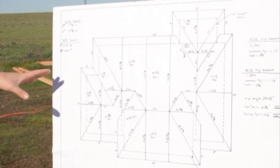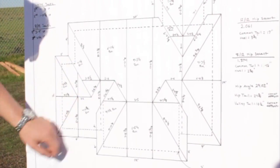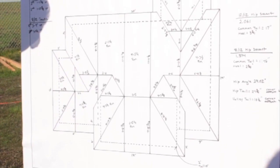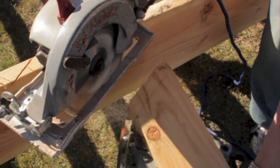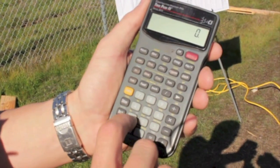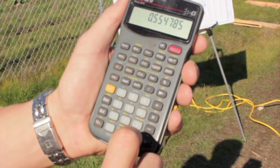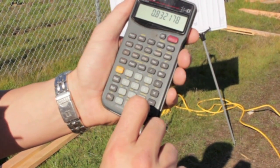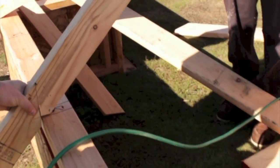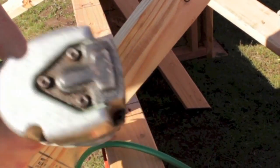When we get back on site, we're going to see that we've got our plan board with all our measurements and calculations, and then we're going to start cutting. We're actually going to assemble the roof on site and show you how to cut all of these rafters' hips — show you exactly how to cut them on the saw and how to use them. We're going to show you how to stack and put the rafters together. There'll be a few more bevels and hip backing bevels that we'll show you how to calculate in the field as well, and you'll see that we're going to assemble it here.